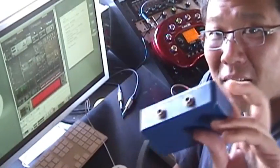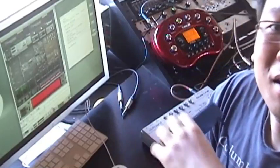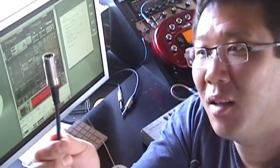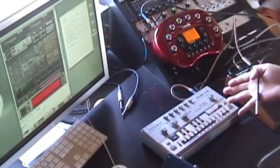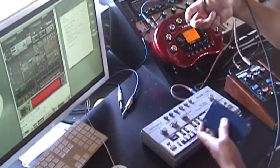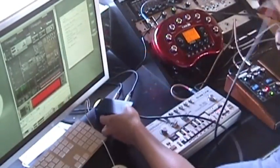I made an interface box here which takes quarter inch audio signals coming off my MOTU 896HD and converts them to Roland DIN-SYNC, which I'm then going to connect to my little friend here, the TB-303. One handles the clock pulses, the other handles the start-stop.